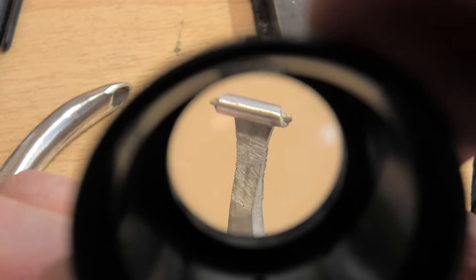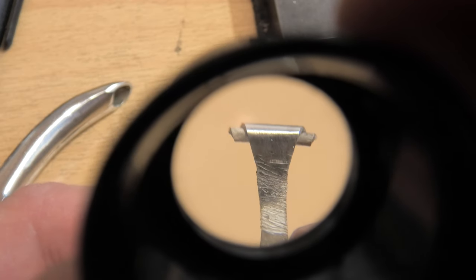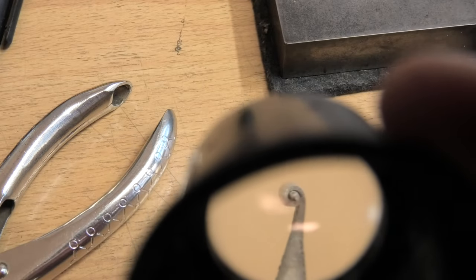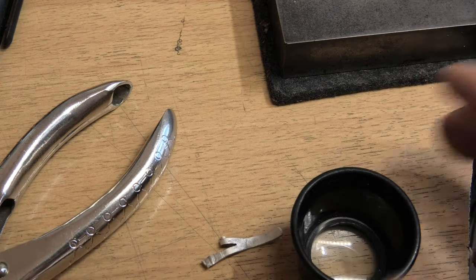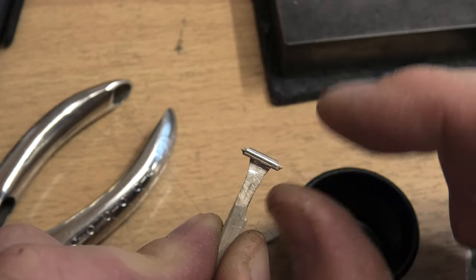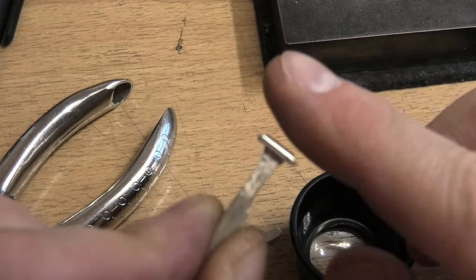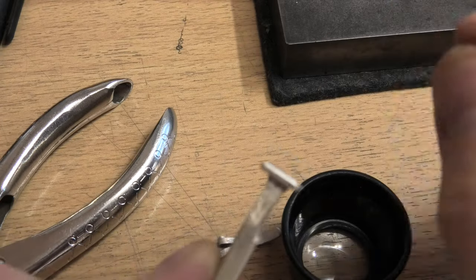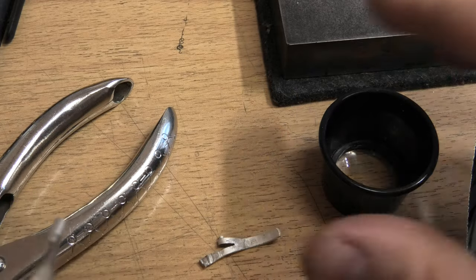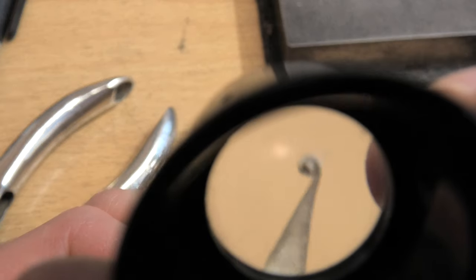It's not difficult, but you've just got to help yourself out by thinking ahead and having the metal a certain thickness. About half a mil — it was 0.55mm that I milled mine out to — and then that flat section was as wide as it was long. Obviously that's really wide, so you could use that on a really big stone. But if you want to do a smaller version, just match that width to the length that you've thinned out to half a mil. That basically seems to be the recipe that worked.